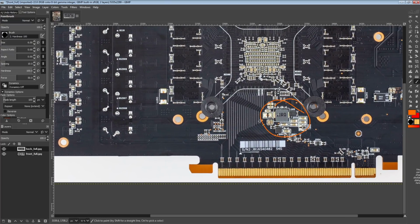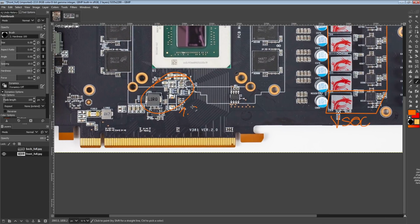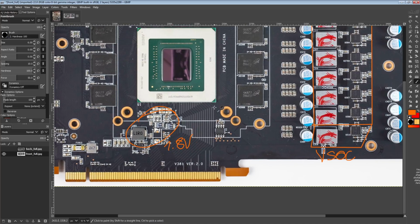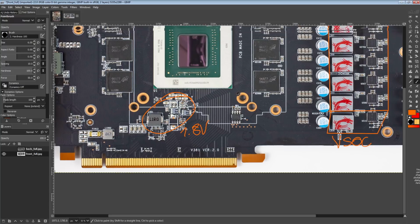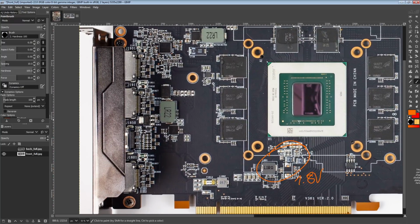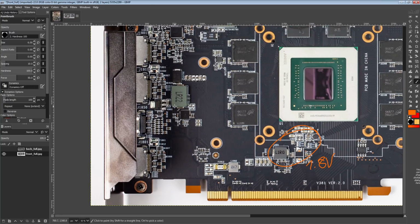So these down here on the card are going to be, there's basically 2 more voltages that you need. You need 1.8 volts, which is for the BIOS chips, as well as all of the GDDR6 chips. That's a supporting voltage for them. And then there's also the PEX voltage, or wait, no, it's display drive PEX. There's another rail that's like 0.9 volts or something. There's another low voltage rail in this area for the GPU. I'm just not sure what it's officially called. Normally I call it display. I think it's display drive, and it might also include PCIe. Not sure right now. Anyway, you've got your minor voltage regulators down there.